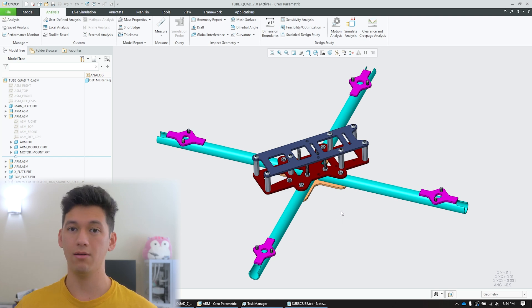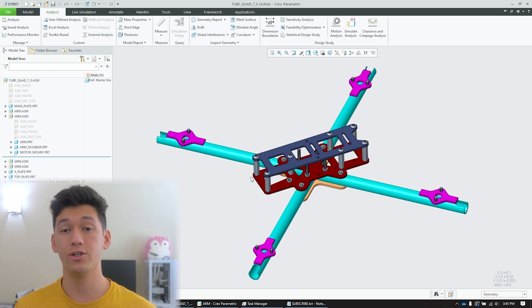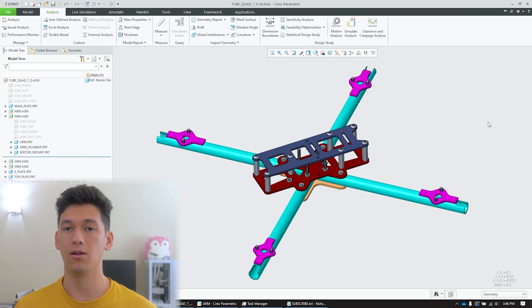The overall geometry is the same. It is still a Truex design with some space between all the props. The Truex geometry is to try to get a similar feeling pitch and roll axis, given that this is a freestyle quad. The space between all the props gives the props cleaner airflow, helping avoid weird tuning issues and inefficiencies. The fuselage is quite short and the battery goes on toilet-tank style or sideways, to get a lot of the mass in a very small area in the middle of the quad, reducing the moment of inertia and increasing responsiveness.